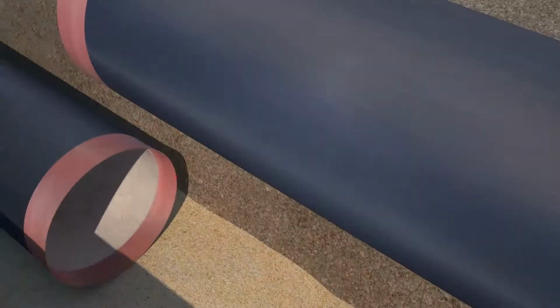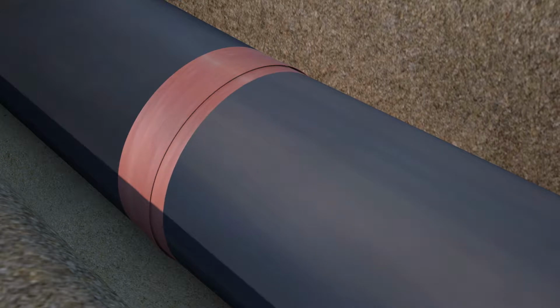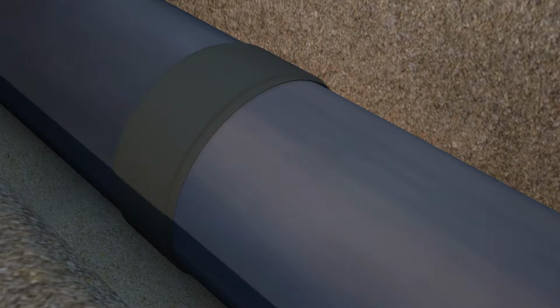The prepared pup is installed by inserting the spherical spigot into the spherical socket. The angle of the pipe is adjusted to enable the correct location of the bend. The pipe is welded and reinstated with a heat shrink sleeve. The maximum amount of angular deflection allowed for this joint is 3 degrees.